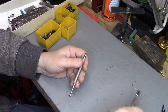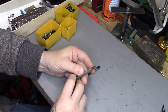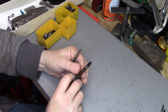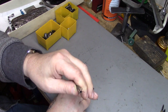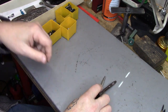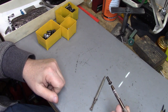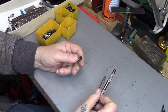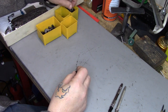Today I want to talk about work holding — specifically fastener holding. Long-time viewers have seen me use these claw-type grippers. These are used a lot in the jewelry trade for holding gemstones. I have some that have five prongs like this one; more commonly available now are these four-prong ones. I've used them to grip the head of a screw and get it in position to insert it into machines. That works well and good in many cases, but in some cases it doesn't.